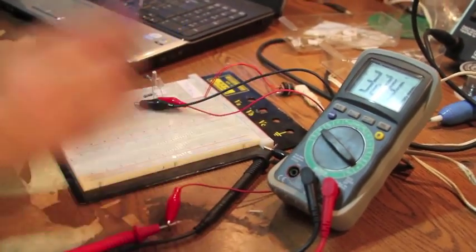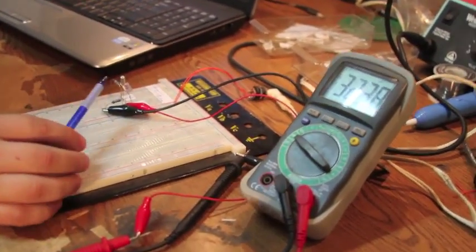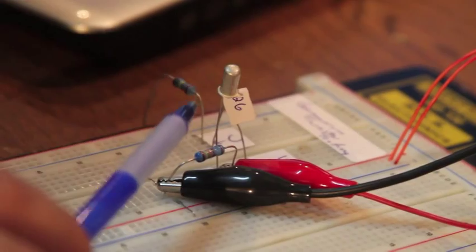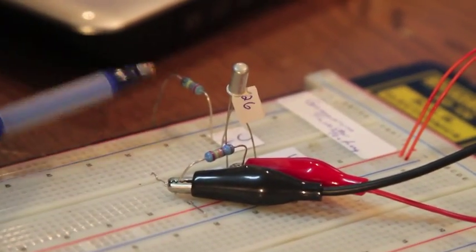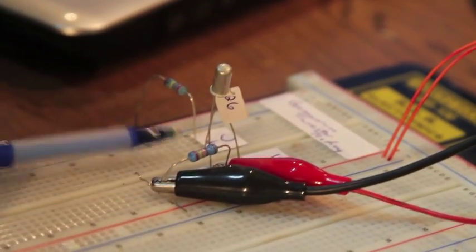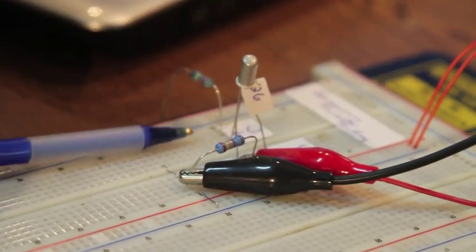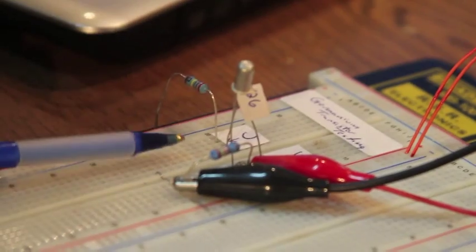What kind of resistors do you have, and what leads are they going to? Okay, well, we've got this 2.4K. He's going from base to ground. And then we've got a 2.2 meg that's going to go from the collector to ground when we're looking to load or activate the transistor and then compare for gain.